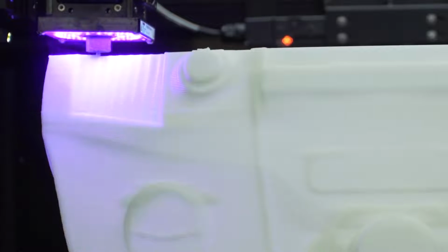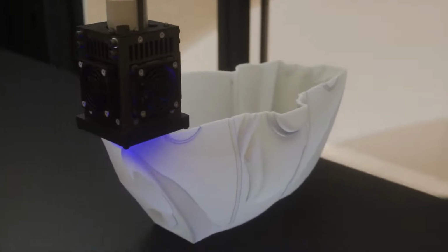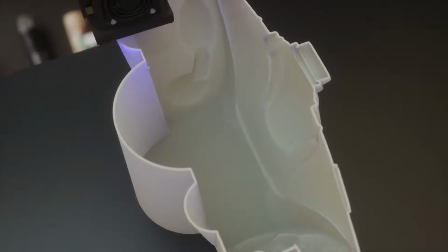During the 3D printing process, the gel viscosity varies to ensure both adhesion and perfect bonding with the help of UV curing. Due to its high speed and the capability of the gel to cure on the fly, Massivit 3D technology enables production of hollow, sturdy models, and unlike other additive manufacturing technology, does not require additional support to be produced during the printing process.